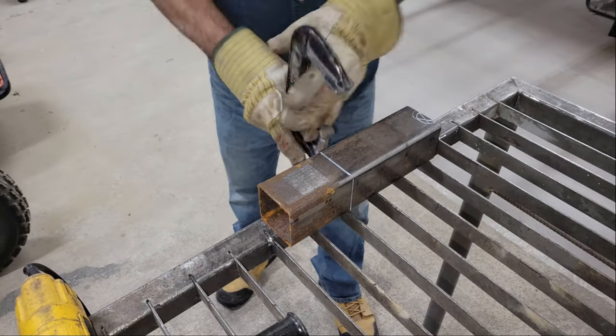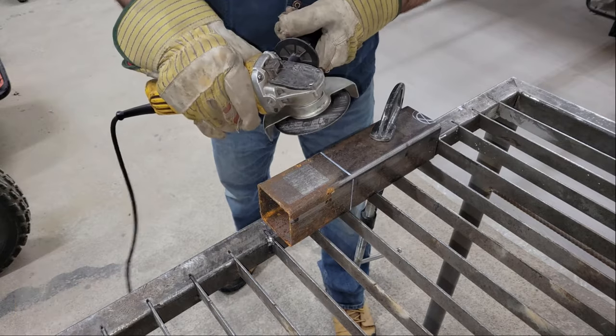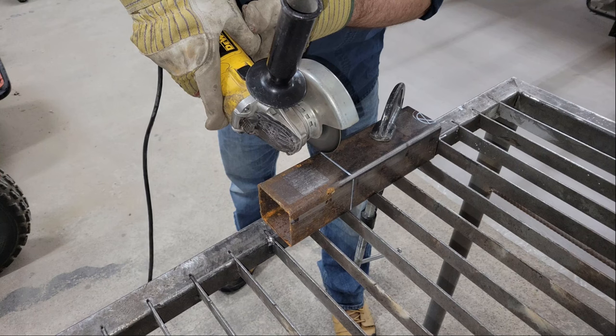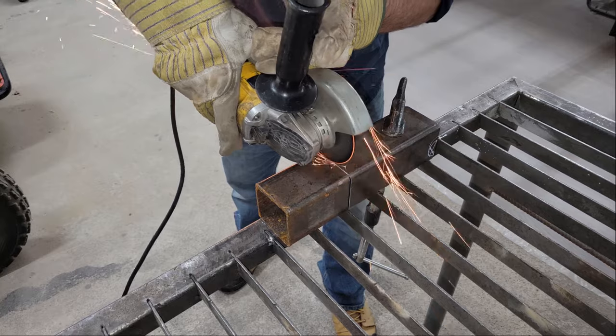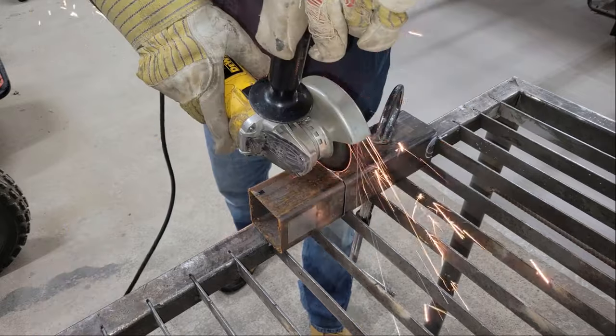With that said, after running a few more test beads, I moved on to making the fixtures for the motorcycle jig. If you've watched the build video for the chassis jig, then you know these fixtures aren't complicated at all. They're just a couple of plates that are drilled and welded to some tubing. The one that I'm making today has to receive the front wheel axle, so a semicircle needs to be notched in one end, but that's the hardest part involved. The rest is pretty self-explanatory.